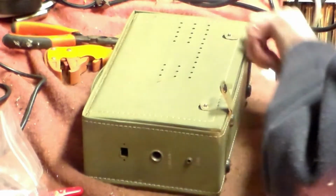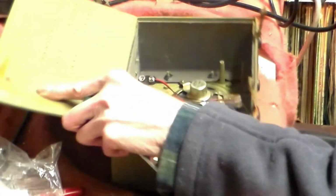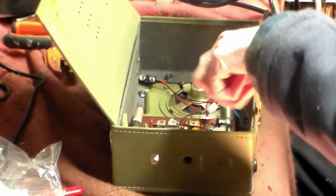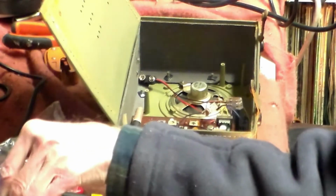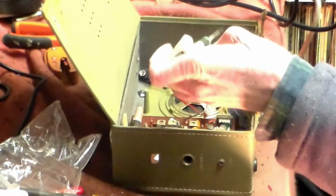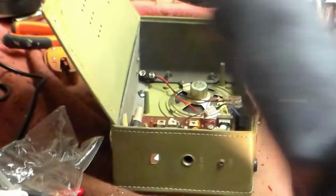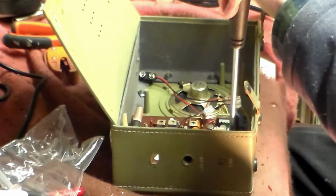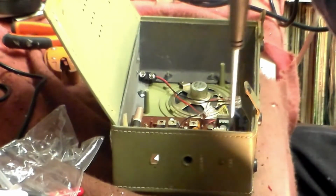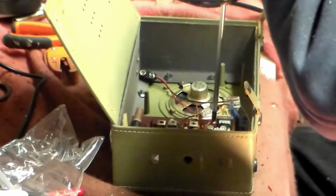And of course on the back here there's screws holding the printed circuit board down, which also have to be removed rather quickly. So I'll get something which will shift them, and I'll have a good look at those output transistors, which I bet you any money will be the problem with this radio. It's quite simple, and you can usually tell. When a transistor like that is open circuit that way, two things are apparent. One, it will sound particularly bad, as you heard this one did, and it will also take the battery down rather quickly.